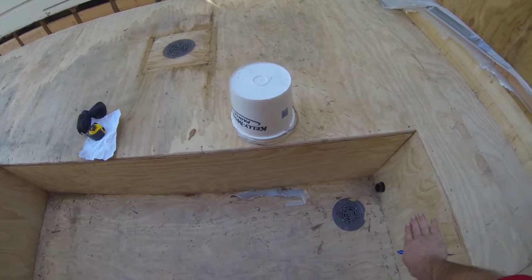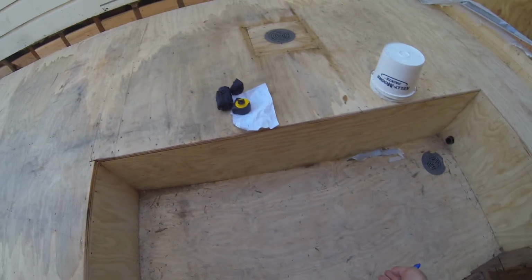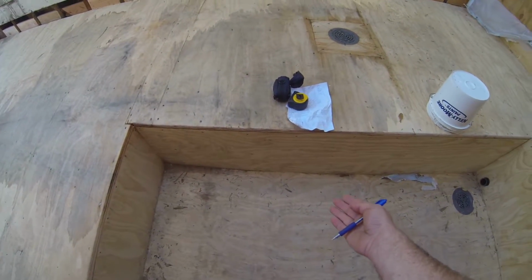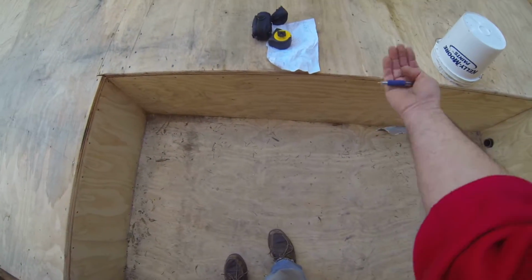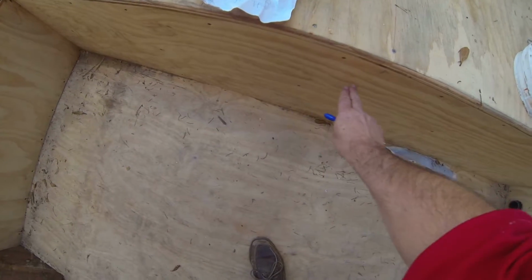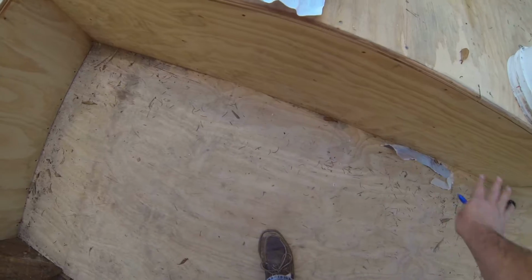So if you put this lower deck in and you come up the standard, I'm going to call it 4 or 5, 6 inches on this side, 4 or 5, 6 inches this side, but on this wall here you run the piece longer, so it basically comes up almost to the top right here. So make this piece longer as it comes up. Then when this piece folds over the 4 or 5 inches, you'll heat weld it here and it will counter flash this, and all of this will work fine.